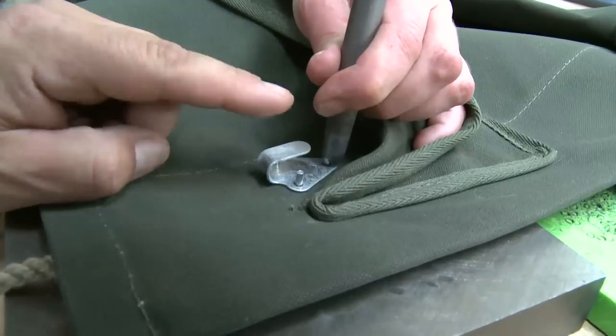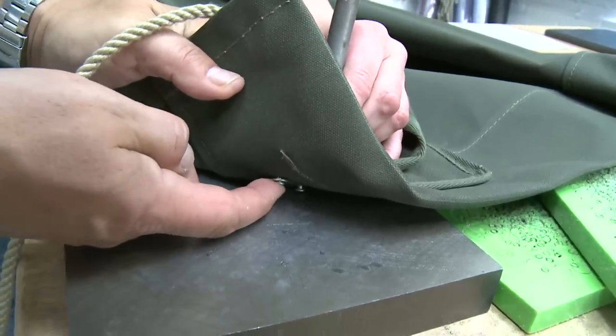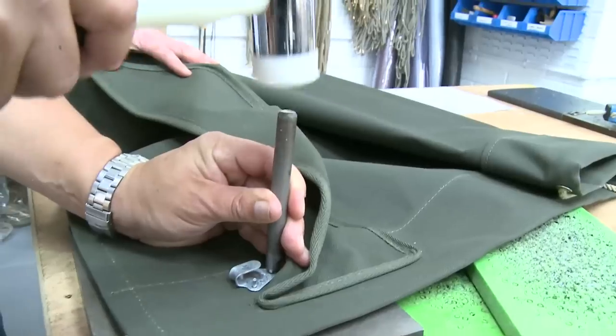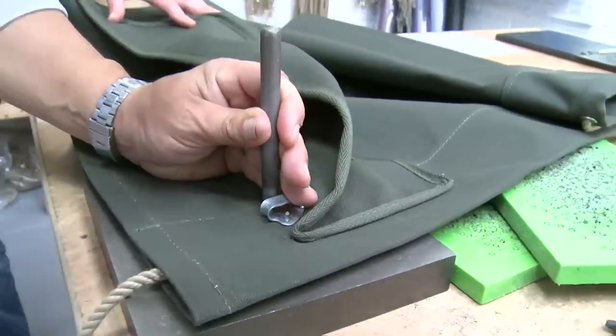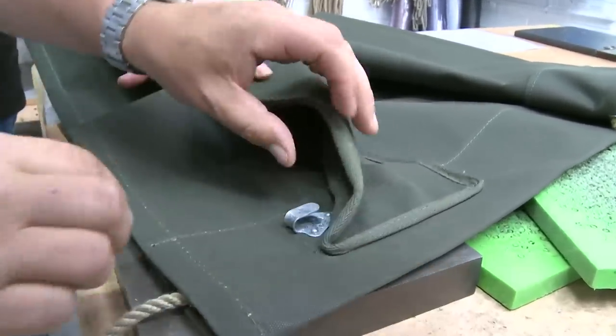So now we've got the top plate and the hook and the under plate on the other side with little aluminium rivets go through. We use aluminium rivets for what we originally used, and we start off with the front one and we have to give them a good tap, and they go down as a blind rivet and make a very neat finish. And these ones are a little bit trickier. One good swipe and they go in. That's it. And the hook's on.